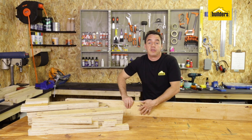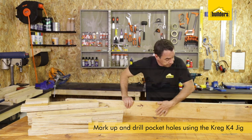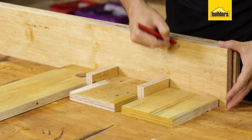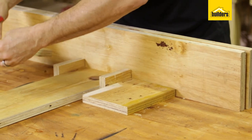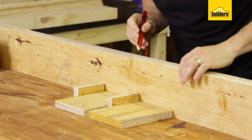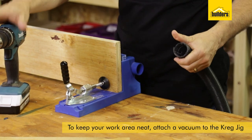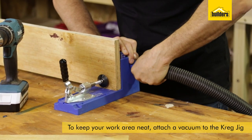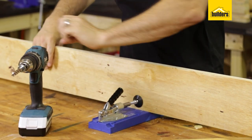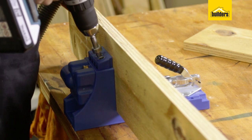We're going to start off by putting in our pocket holes on the inside. The nice thing about this project is everything is hidden away — you're not going to see any screw holes or screw heads. My slats are going to be sitting on top and running all the way along. I've got to mark out where my pocket holes need to be, using the thickness of the timber as the spacing between each slat. I'm only doing seven slats for the base; the lifting back will be separate. The Kreg tool can be quite messy with sawdust, so I'm using my vacuum to keep the working environment clean. I'll proceed with the pocket holes all the way down on both pieces — the second is a mirror image with the timber on the other side.